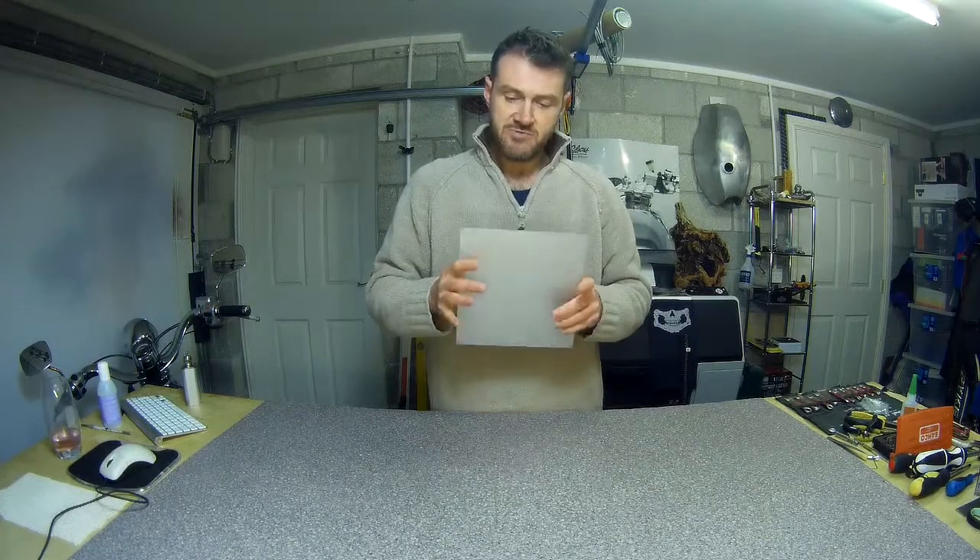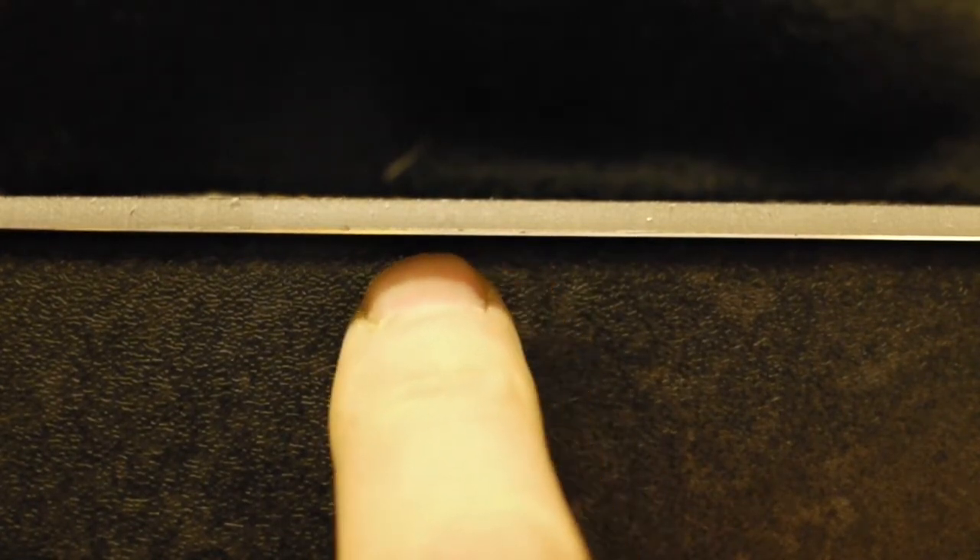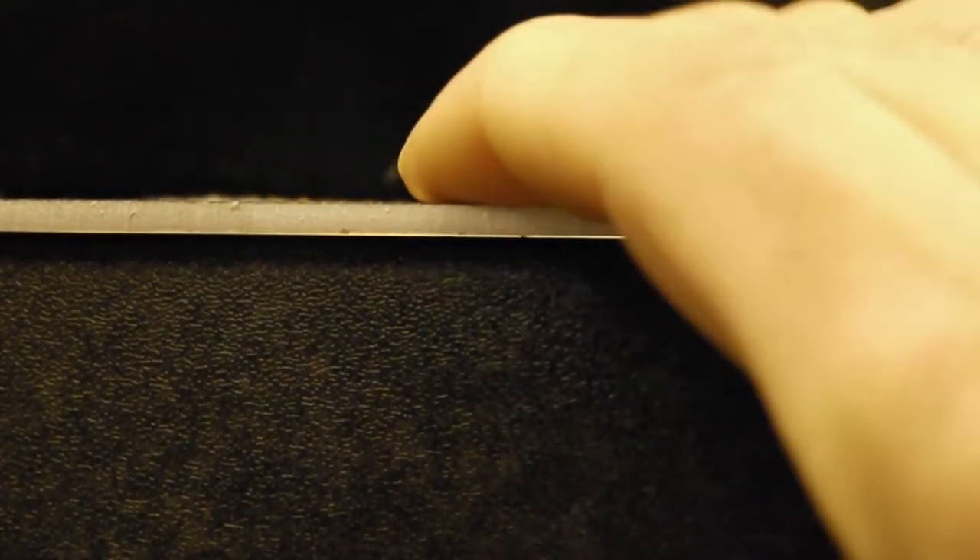It is slightly bent — let me show you something here. This is the bed on my makeshift flat level surface. That gap of light you can just about see is the gap between the level surface and the bottom of the heat bed. You shouldn't really be able to see any light through that. If I squeeze it down you can see the gap goes away. It's just less than one millimeter, but that's a significant gap on a 3D printer when you're talking about layer heights of much less than one millimeter.